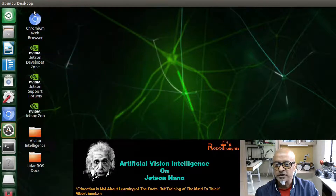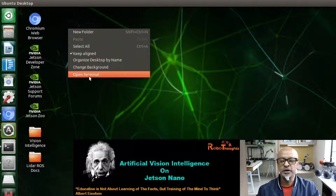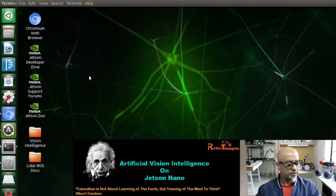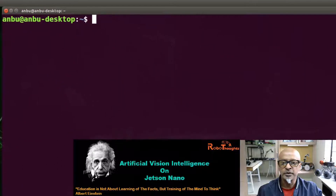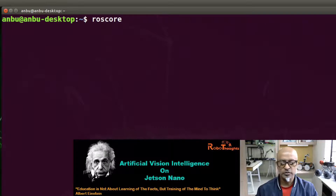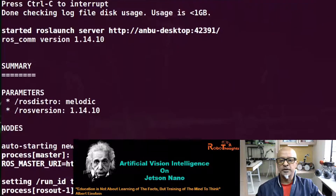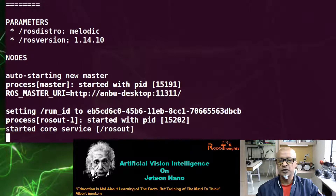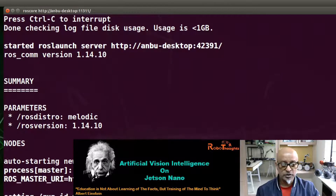Minimize Arduino — do not close it. The program is loaded. Right-click and open a new terminal. Now we need to launch the ROS core. Type 'roscore' and execute it. You will see at the bottom of the screen it says 'started core services', which is good.